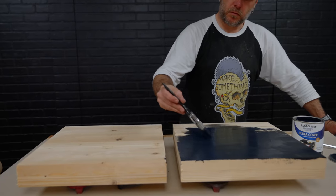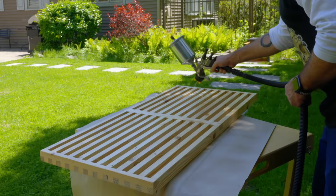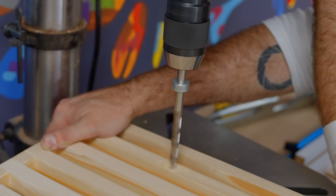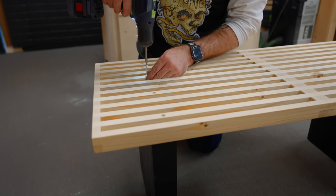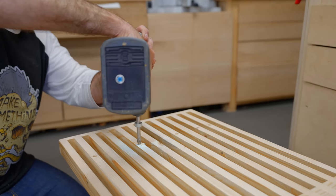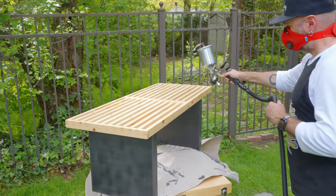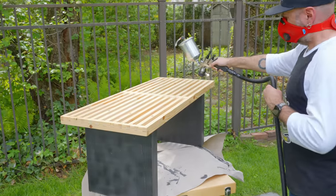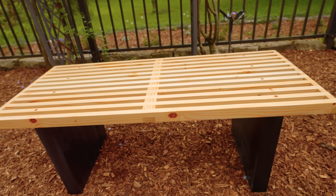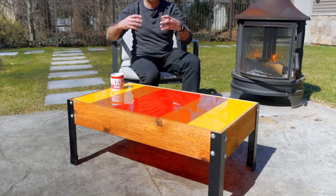The legs got painted with some outdoor paint — two coats on all the sides, four coats on the top and bottom, because it's end grain and it's going to be sitting on concrete. I did use some spray lacquer on both pieces before assembling. My thinking was to drill in from the top and use some two and a half inch screws to attach the top to the base, but I didn't feel comfortable with that, so I took out the screws, drilled in much deeper, and used dowels instead. Then I took it back outside and did a few more coats of spray lacquer. I was going to use a marine varnish but it's too thick for my HVLP gun, so I put a ton of spray lacquer on instead. It came out good — I think it's going to hold up just fine. If you like this project, check out this outdoor patio table I made using nothing but basic power tools from a home center.